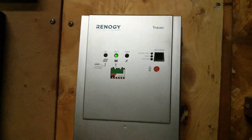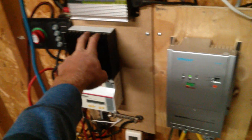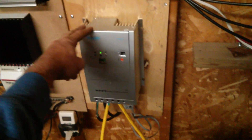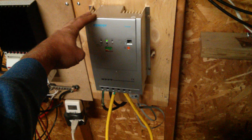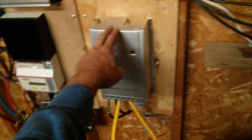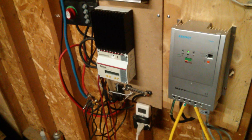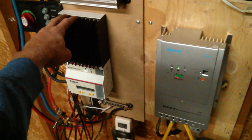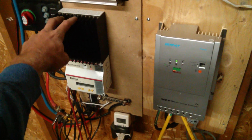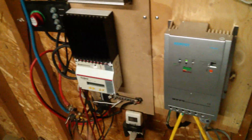This is the newest addition to my setup. I still have my PWM on half the solar panels because this can only handle 500 watts at 12 volts, which my system is. So I'll be purchasing another one of these to replace this one — this one is a very good charging controller — and I'll be repurposing it somewhere else, or maybe installing it at my grandpa's place.